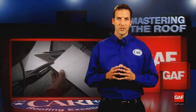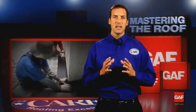The importance of flashing is often minimized and its installation is sometimes ignored, especially in poor roofing installations. Flashing is used to seal and protect joints in a building from water penetration by directing the flow of water away from these otherwise vulnerable areas. For flashing to function properly, it is important that it is installed correctly. Let's take a few minutes to review proper flashing installation.